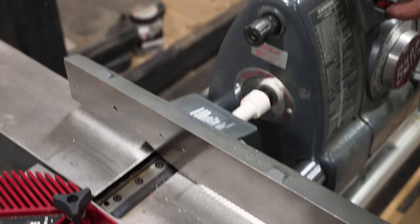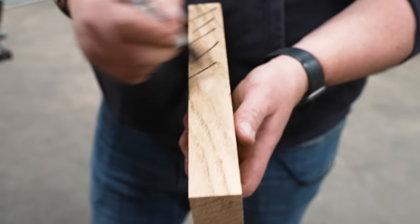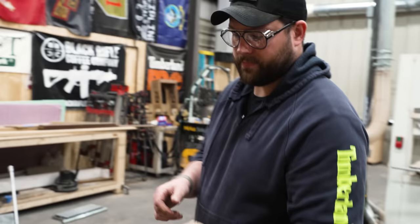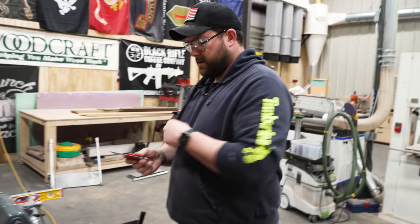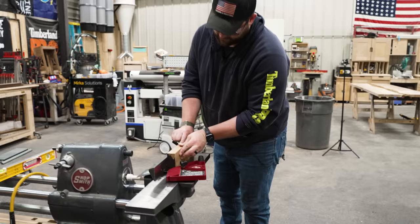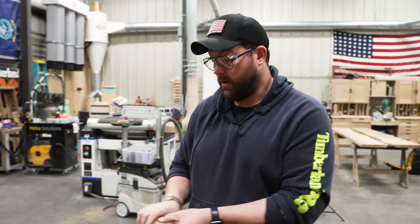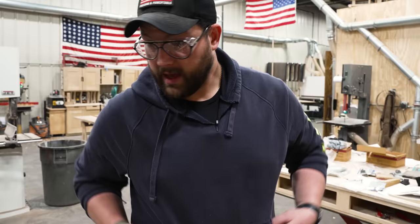Ready? Yeah. Not too bad. For the sake of what the hell it is — being a very tidy joiner — that was pretty smooth. Very, very shallow cut. Fence is definitely out of square again, even though I think you guys watched me adjust it to square like five times. Let's try this again. Let's give her another shot. Scary as hell. You got a nice square cut there, but I really don't like how once you come through the material, if you want to keep pressure you lose the fence over here. I just walked it off the fence. I'm not a huge fan of this.